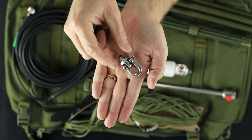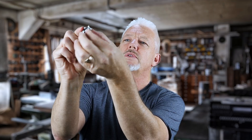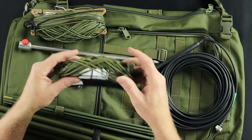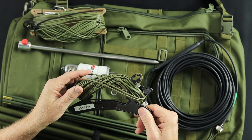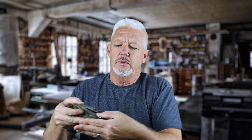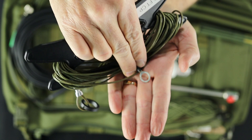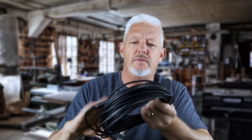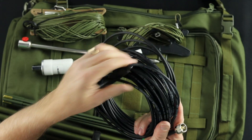The shackle is a custom piece of hardware — it's a swivel drilled into a 3/8 bolt, and you can get this on their website. This shackle is going to be useful for putting the antenna up in a couple of different locations. The main wire for this antenna is 73 feet long, and the counterpoise is 25 feet of wire that also comes with this antenna. The wire has a little ring terminal on one end, which is meant to screw down to the bottom of the hybrid micro or the mini. Also in the kit is a 50-foot section of ABR Industries coax with a built-in choke.